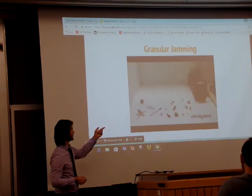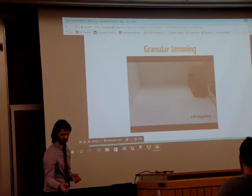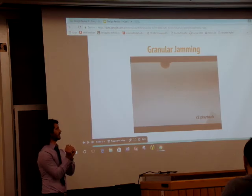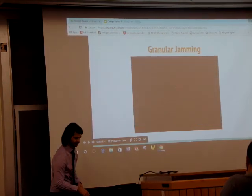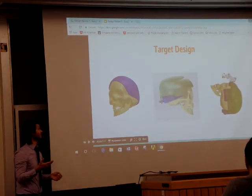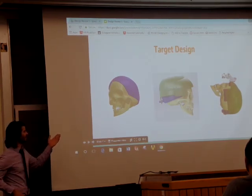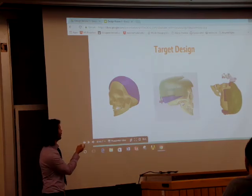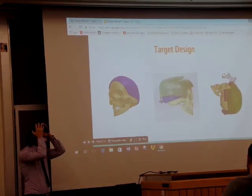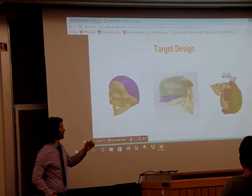This is great for trying to pick up things as opposed to a little robotic claw. Any time you take your balloon, put it over some object, and remove the air, it conforms perfectly to the geometry. So we make a skull cap out of a balloon filled with coffee grounds, put a port on the back that runs to a pump, create a vacuum so it conforms to the geometry of the head, and then attach a shell over the top to provide a mounting place for the robotic arms.